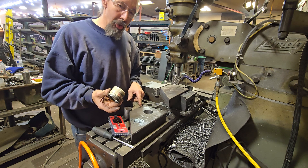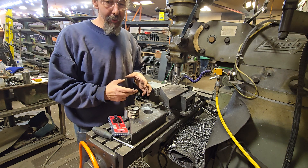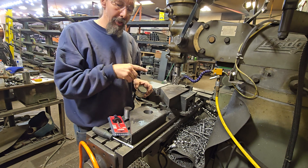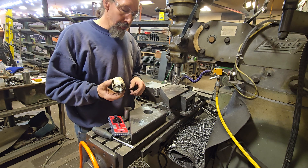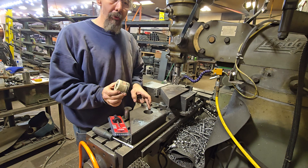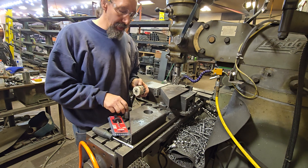You can also do it with a hole saw. I've got a video from about 3-4 years ago where I was boring a 3.5 inch hole through about an inch and five-eighths thick. A hole saw for larger holes that don't have to be accurate — on that one I needed to use a boring bar to clean it up for a bearing. If you use a hole saw, I typically recommend drilling a pilot hole in the path of where your relief is going to be. On a piece of 2 inch like this it would probably take about 20-30 minutes to get through.